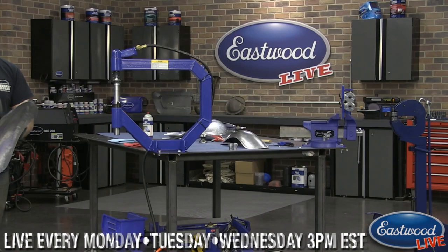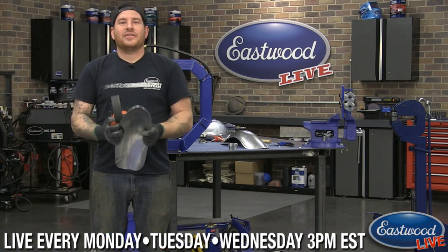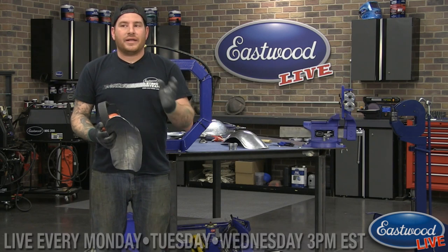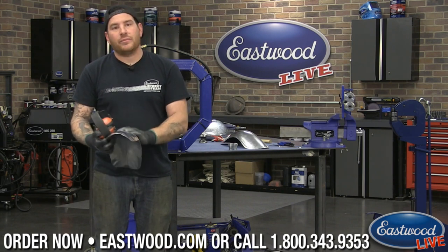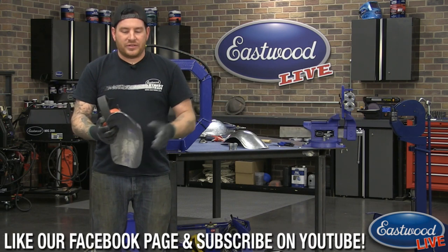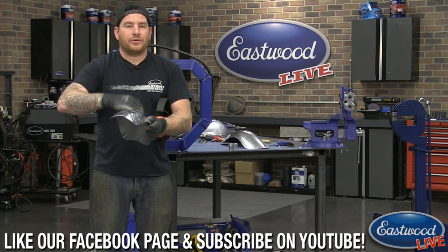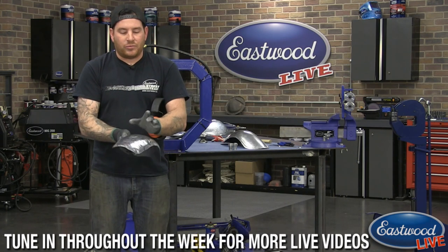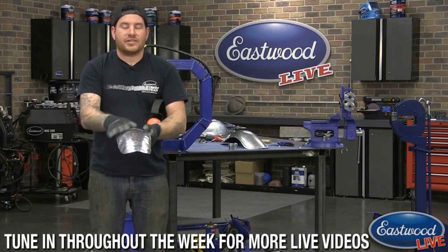That's a good question. So for the English wheel, as mentioned, some of the wheels are not as sharp. So the English wheel, depending on how narrow of a wheel you have. If you have a really high crown wheel, you would be able to do the same thing on an English wheel. It might take a little longer. But the big problem is, especially on something that's small like this, but has a pretty heavy crown or shape to it, is that the English wheel, the bottom wheels, if you don't have a sharp enough one, they're going to run on the edges and it's going to actually create lines in the piece instead of smoothing it out.